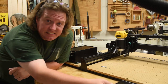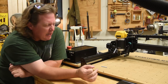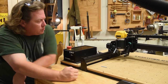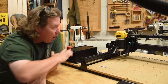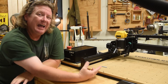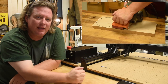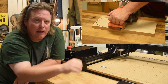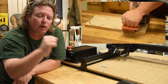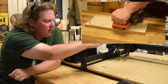The first thing I want to tackle is the easiest: the flatness issue. Right now, from the factory, this is flat enough for most work people are going to be doing — sign making and all that, just great. But if you're actually cutting all the way through a product, making sure the distance between the bottom of your bit and your wasteboard is equal all the way across will allow you to cut through it and just slightly touch your wasteboard. A very common issue I had with my last one is that when you go through a cut with tabs, it doesn't always go all the way through — or it might go through in one spot and not another. We're talking thousandths of an inch different all the way around.